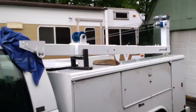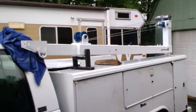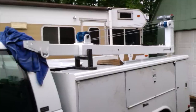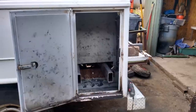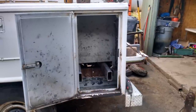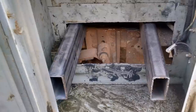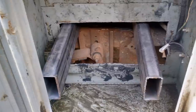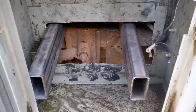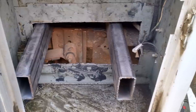I'm going to show you some slideshows and talk about what you're looking at as we go. One thing you'll notice is the bed of this truck was not designed for a crane, so we had to sacrifice a compartment to set the tower on. We started by cutting a hole in the bottom so we could put 2x4 steel tubing across the frames, bolt them in, and that's what we weld the base of the tower to so it can handle all the weight.